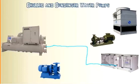It's possible if you were to supply this coil with water coming into the coil from this direction, that the water may not actually fill the coil and you'll get air in this coil, which would mean that you're not going to get cooling on the upper portions of this coil if there was just air there, and water would flow and then come down and get sucked out the bottom. So the reason why they fill it up from the bottom is that way you make sure you pressurize the coil and get all the air out of that coil.